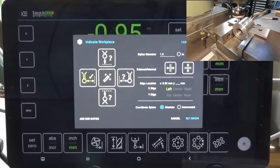Okay, I'm going to take the part out of the vise now. We'll assemble the quill handle and we'll just see how it performs. To do the assembly, I'll need to do this on the machine, because if I drop the ball bearing into that hole now, it would just fall right through. And I'm going to back up the ball bearing with a piece of Teflon.